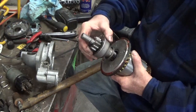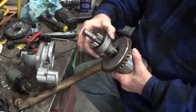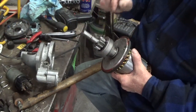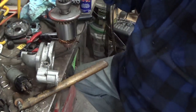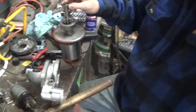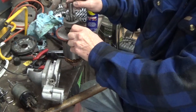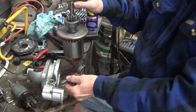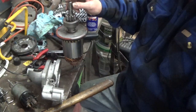Okay, so then I put this gear on here, and you can check the different splines, or the teeth rather. Make sure it's working good. There should be nothing really bothering it. I cleaned that all out before and put a little bit of oil on it. So that's good. Now, the next thing we really want to put onto this, let me just put this back a little bit here, is this shaft. Now this goes onto this and moves this back and forth, and then this end goes onto the solenoid. That solenoid moves this like this to engage the gear into the flywheel on the machine.